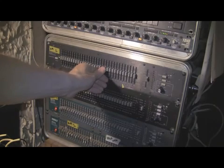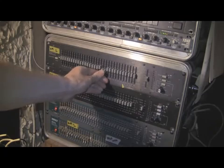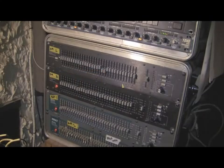That's another live one. I'm going to take these two frequencies down, maybe about 5 decibels. That's 1.25 and 1.6 kilohertz. And now it's stopped feeding back. Check, check, test. Now it sounds okay. Testing, testing.